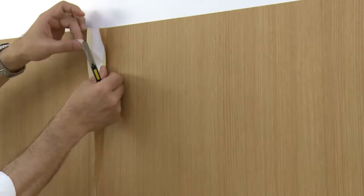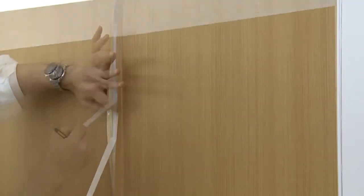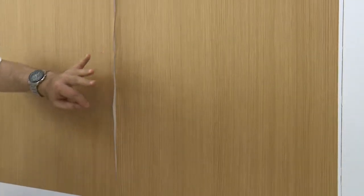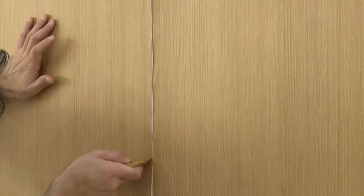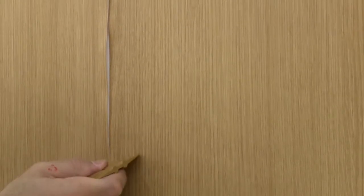Then, lift the edge of the first panel and remove the narrow strip of liner from the second film panel. Use care not to pre-adhere the film to the walls while the adhesive is exposed. Using the edge of a squeegee, draw it across the seam to pull the seam together. Use your finger to check for a smooth double-cut seam.